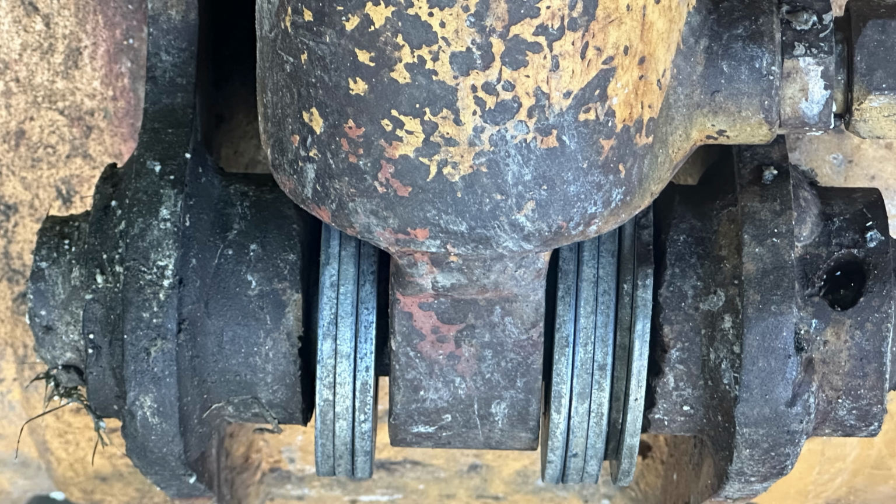So the ram clearly moves too much, so they jammed a bunch of giant washers in there. That's not good. I noticed that the bolt that's supposed to retain the pin in the bushing, well, that's gone, and someone just welded the pin in. So guess what? If the pin is defective or has an issue, you have to cut everything apart to get it out.